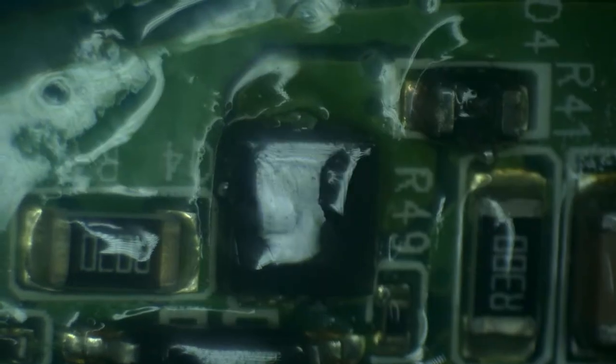Yeah, the diode is heating up significantly. Oh, wait a minute. Other than the diode, there is a MOSFET. I wonder if we have a dead MOSFET. That probably explains a whole lot. Yes, there is a MOSFET on here that's definitely hot, more than anything else. So the MOSFET is bad, likely, and the MOSFET is causing all of the other components to fail.